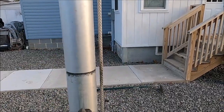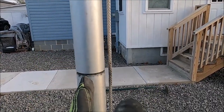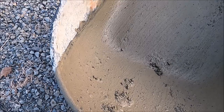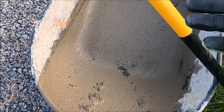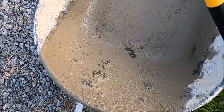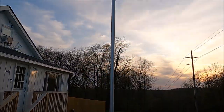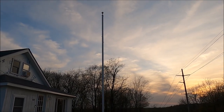When I leveled the pole, I went 90 degrees from each side — leveled up this side and then 90 degrees away on the other side. You'll do that with a post or anything. When you're working with concrete, make sure you get all your tools and your wheelbarrow washed out as much as possible, unless you plan on ditching it. I put the cleat on the very back so as you're looking at the flagpole you don't see the rope — I don't know if that matters to some people, but I guess I'm kind of a stickler.